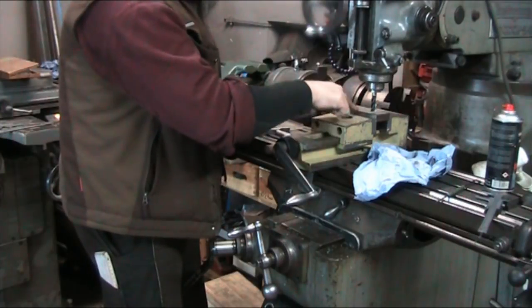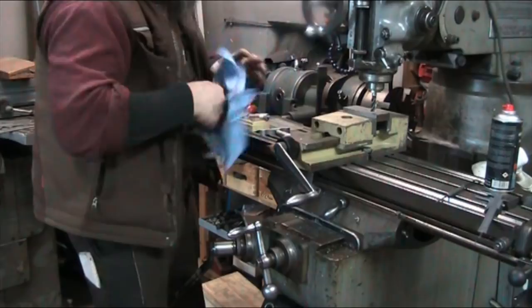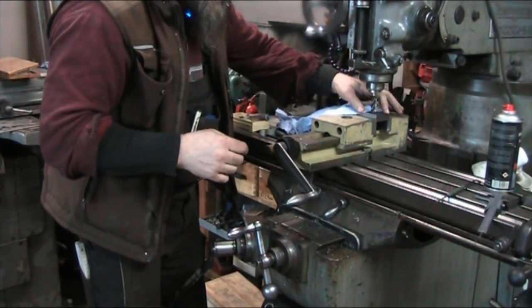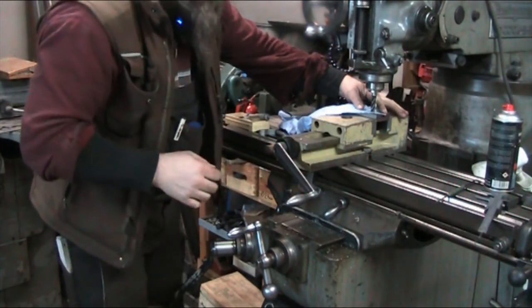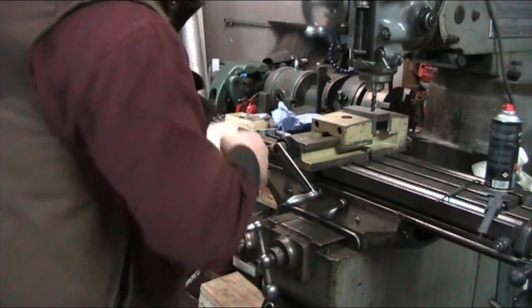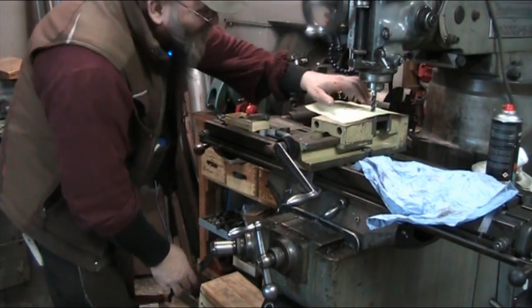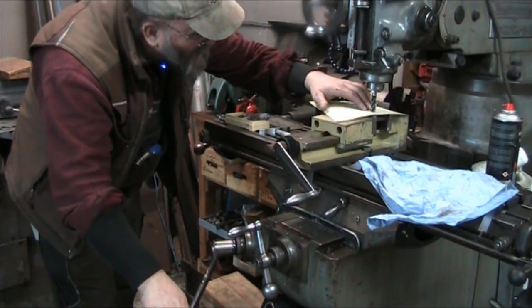We're going to go three holes and three holes parallel. So now how we get our workpiece up to, we're going to use this paper towel here. Actually, we should just use a piece of regular paper. Got an old invoice here. This is a little thinner paper, and so raise it up until it stops moving.